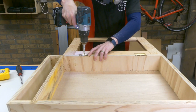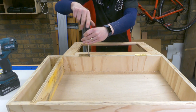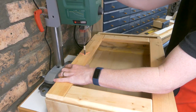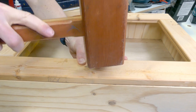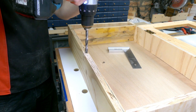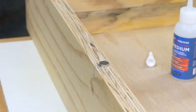If this looks like it went together far too easily, you're right - that door did not actually close flush or even, and I had to go back and re-plug the holes with some chopsticks. But the magic of filming means you don't have to watch that. The smallest piece of scrap wood - a bit of dowel offcut picked up from a dumpster - acts as the handle for my door. A little 10mm magnet will hold it closed. Quick tip: using a brad point bit gives you a flat bottom, which is much better than a standard drill bit when installing magnets. Always check your polarity so your door doesn't get bounced away. Put the magnet down and mark it with an X - that's the face to glue.